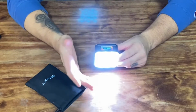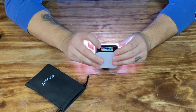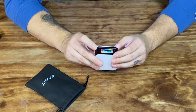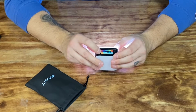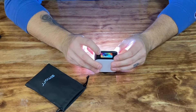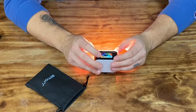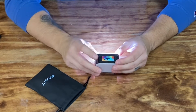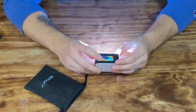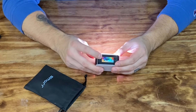You can see that it is bright. You can adjust — right now it's at 100%, 9,000K. I can adjust this down, lowering the brightness to 5% and increase it from there. I can also hit the mode and go over to 9,000K, then lower it. You see how it's turning into more of a yellow or amber — I can adjust the warmth on this. It goes from 2,500 all the way up to 9,000K. This is extremely important when you want good lighting, because 9,000K is a white light. If you want to lower that down and use more warmth on your subject or yourself, you can adjust it down and give it more of a yellow tinge.